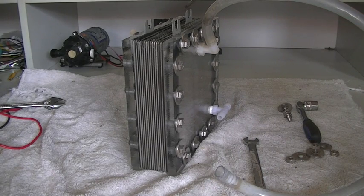We're going to have a look at why Daryl made this the way he has — why the center plate is solid with no holes, is one polarity, and the two end plates are the other polarity. This reduces a current leakage that is not often thought of, which we'll look at next.